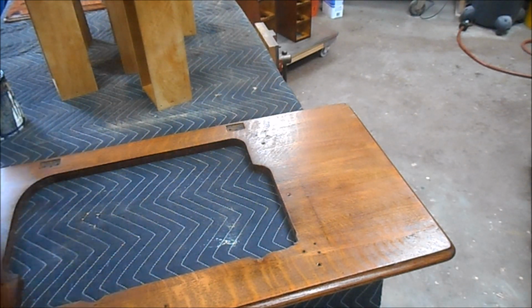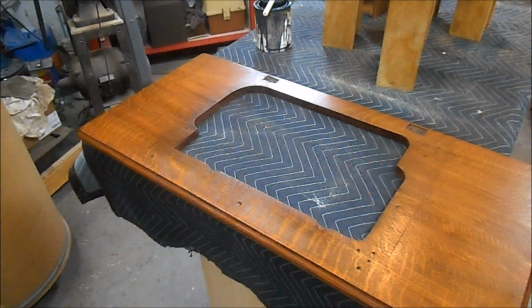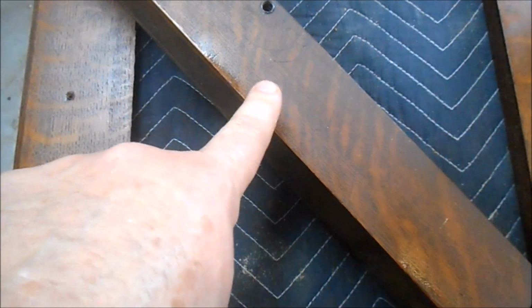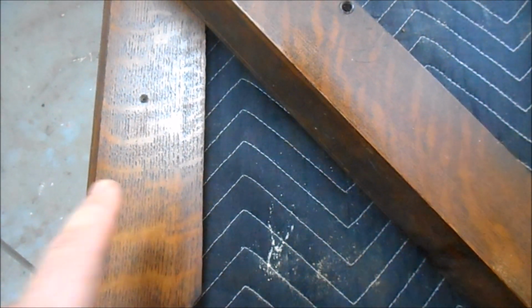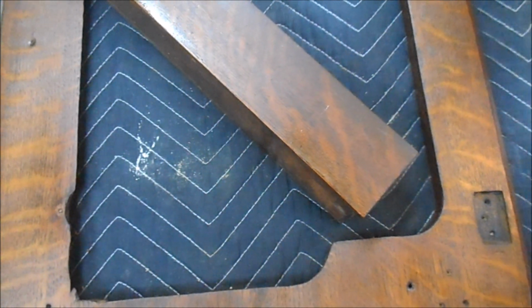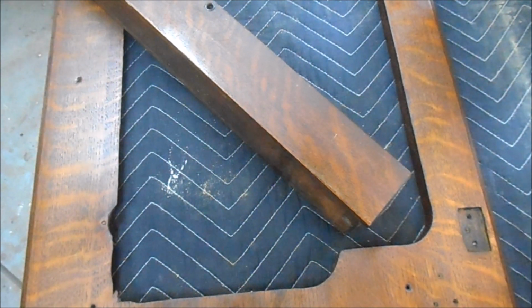We'll use the dry brush technique. Well, what do you think about that match, huh? This is the drawer in the original finish, and this is the top that we wound up sanding down to bare wood, paring off all the veneer, and oxalic aciding a stain out of it. And I think they are just about a dead match. I am super, super happy with the way that color came out. All right, we've got to let this glaze dry. We're going to give it 2 or 3 hours and get in here and I'll seal it.